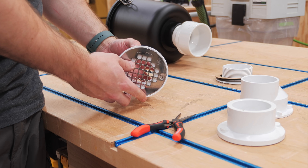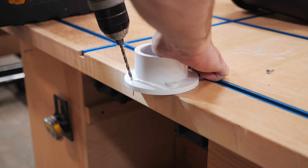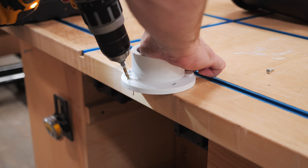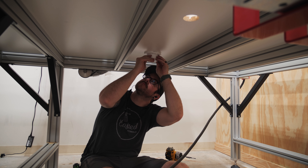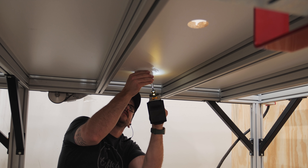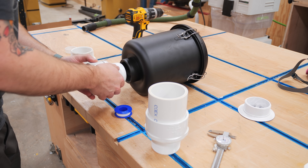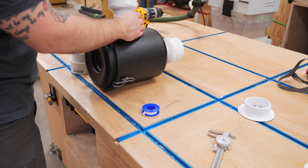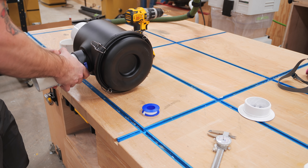The first bit of work I did to connect the vacuum to the plenum was to add these PVC shower drains to the underside of the plenum. I pre-drilled a few mounting holes through the shower drains and then mounted them to the underside of the plenum centered on the holes I had cut earlier, adding plenty of caulk to seal that connection and then screws to attach them permanently. Next, I attached the 3-inch threaded male adapters to the canister filter, which runs in-line in the vacuum ductwork to keep any fine dust from getting into the vacuum pumps.